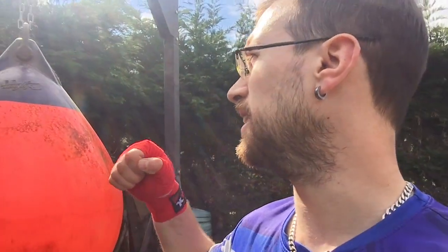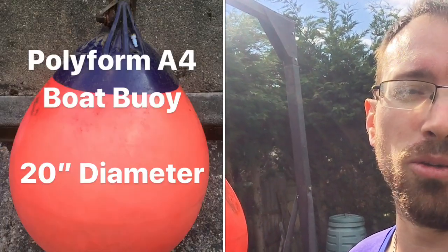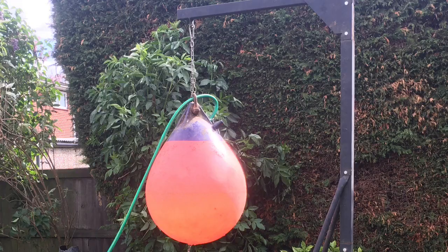This one is a boat buoy — it's a Polyform A4. I was aiming for an A2 or A3 ideally. While I've got it here, I'll show you how to fill it up. There's a little nozzle on the top — flat blade screwdriver, twist it open, there's a little air valve inside which you can just poke through with a screwdriver, then fill it with the hose. It takes a while, but go for it — definitely try it.